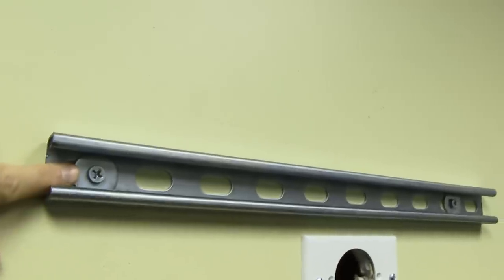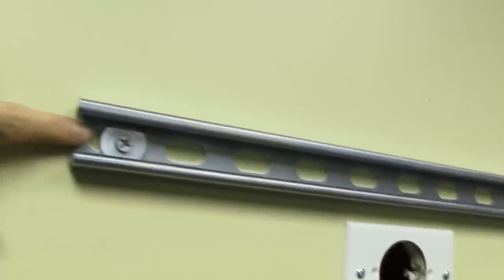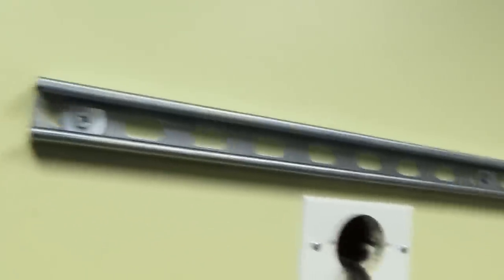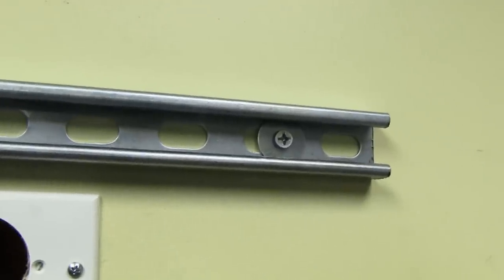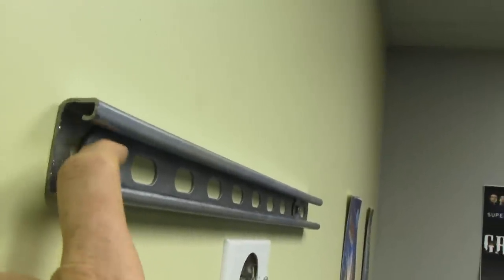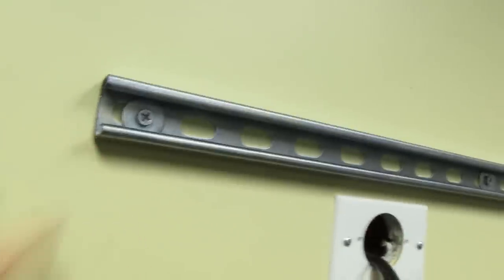All you do is secure it with quarter-inch holes and one-and-a-quarter-inch washers — they're big, so they fit in there. You have to kind of slide or wiggle them in. It's holding down that whole plate. You can use a Phillips head or a hex bolt, just make sure there's enough room for the other piece of Unistrut to latch in — you don't want the bolt sticking out too far. I bolt these directly to the stud itself, so use a stud finder to locate your studs. It's very, very strong — I could hang on this and it would hold me.